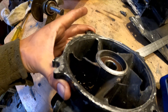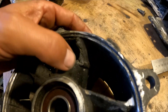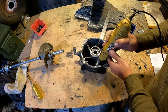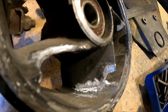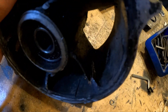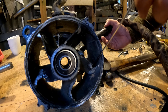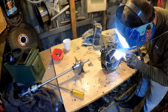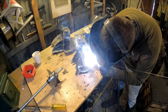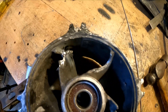This piece here has huge chunks taken out of it — rocks have gone through it, I think. There are cracks in it as well, and someone's tried to fix it before, but it's also been painted so I have to clean all the paint off and build it back up. Turns out the crack goes quite a way down on two sides. I'm going to try and weld in the back side there as well, which means putting the torch behind and welding with the wire on the front side — that's going to be really hard.